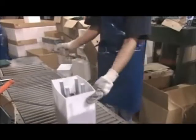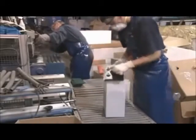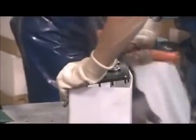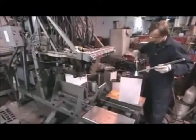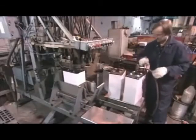Each cell goes into a polypropylene casing called a jar. Each cell is tested to make sure it functions properly, which also shows if the cell is positioned correctly in the jar, so that the positive and negative signs on the cell cover will be on the corresponding posts. The cover is heat sealed and the protruding posts are sealed with lead. Air is pumped into the cell and soapy water is brushed over the cover to test the seals. Any bubbles indicate a gap that needs to be resealed.